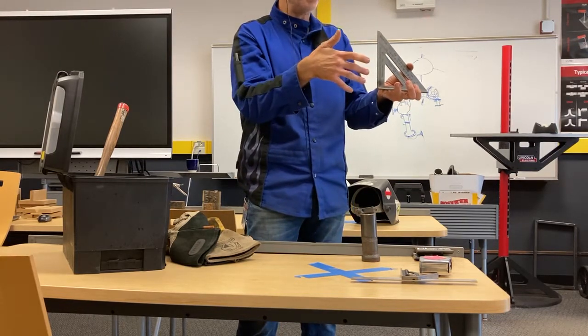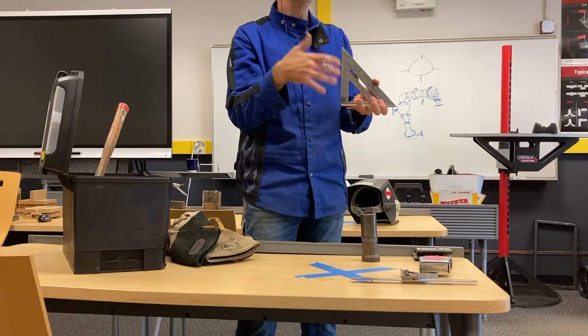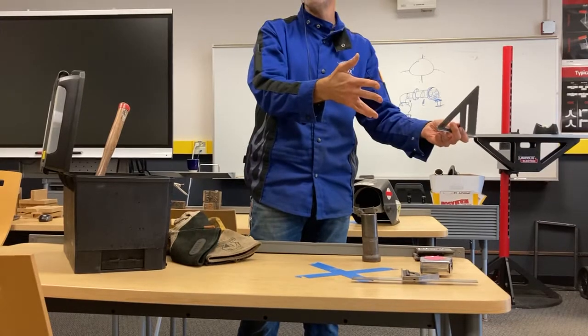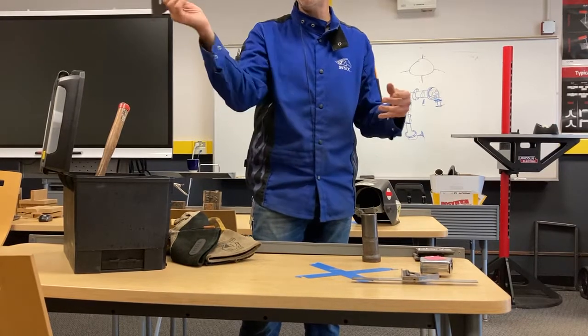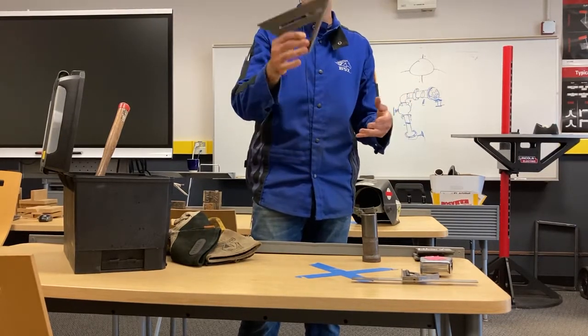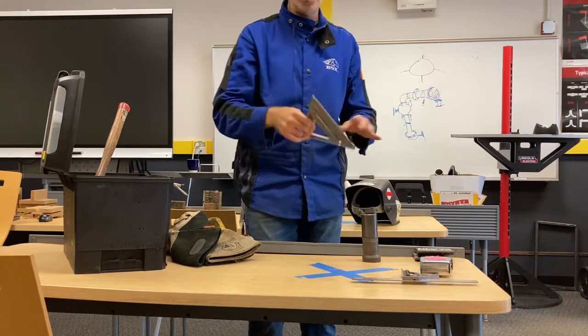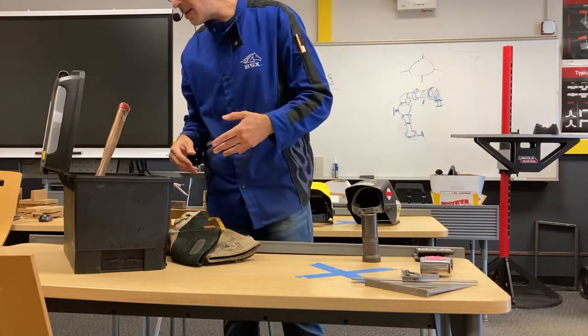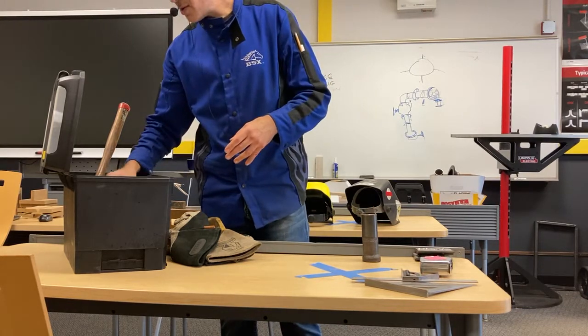A square and a tape measure are a must when you show up to your first job. Speed squares are another really good tool — they're not expensive, they're aluminum so they're not that accurate, but for quickly squaring up jigs or for tacking, they're invaluable. Because it's aluminum, if you're tacking really close you don't run the risk of welding it to the surface — and since it's not expensive, if it gets beat up you can just toss it.